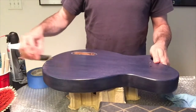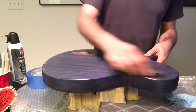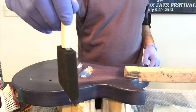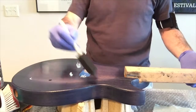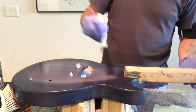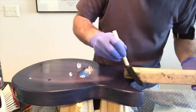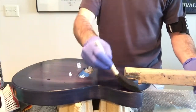Back to the clear coat. I roughed up that first coat using the 400. I didn't want to sand too much because it would be too easy to go through it completely and take off more stain. This is the second coat — putting less on the brush. I do not want any more runs and drips. I did just the front and the sides and let that dry for the full three hours allowed between coats, then flipped it over and did the back, so it took twice as long but I didn't want to risk the clear coat not leveling as it dries.